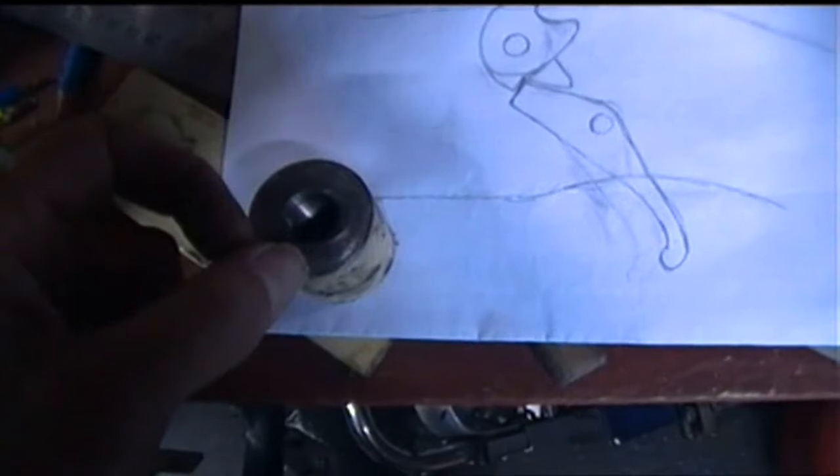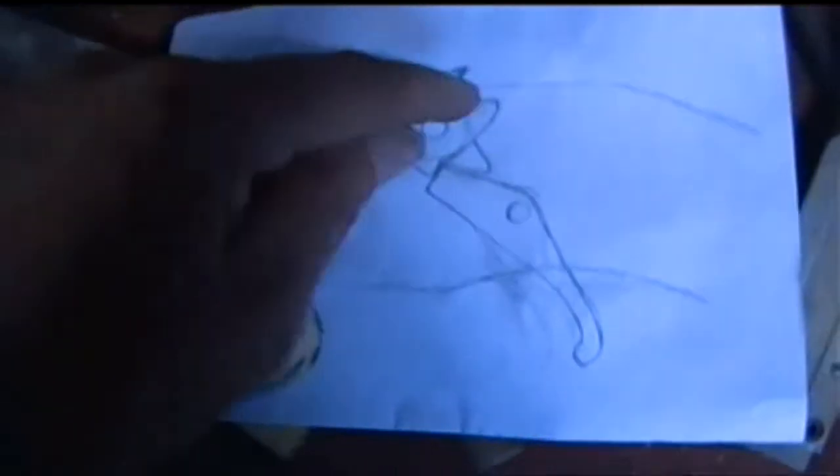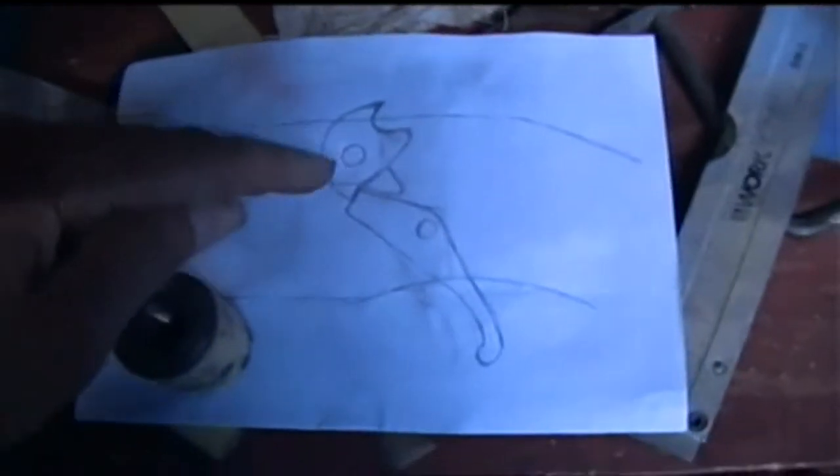So basically, the idea was when the bow is caught in the slot up at the top here, there's a little indent down at the bottom here where the trigger mechanism would latch into. And the idea is the slot's fairly big, and when you bring the bowstring back, you actually push this round release mechanism backwards by pushing the string into it. And when you push that back, so on, pushing on, say, that point there, that part rises up, and the trigger mechanism latches into the other piece down at the bottom. So effectively, that's what I'm doing here.